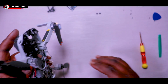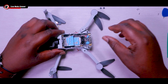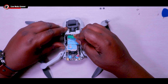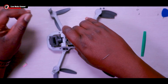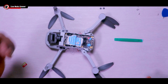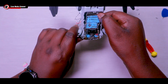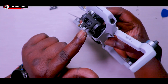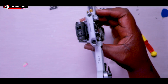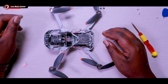I'm going to turn it off now and show you how to connect the board properly. I skipped the antenna cables and also the gimbal and GPS flex, so I'm going to put those back properly. I'm connecting the gimbal and the GPS module flex now and putting back the antenna wires — we have two antenna wires from the two front propellers. Then we put back every other part we've taken off. But first, it's always good to test again with the battery — the gimbal rotated, so the gimbal flex is fine and the gimbal is working.